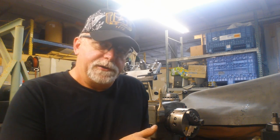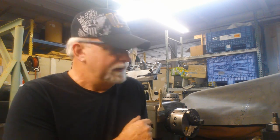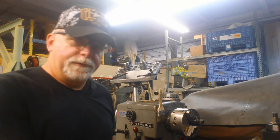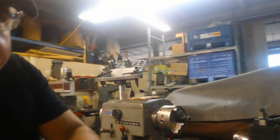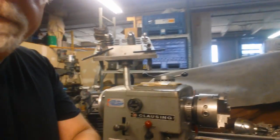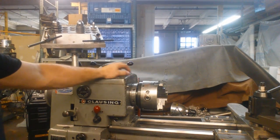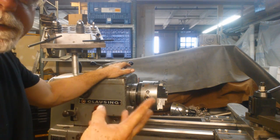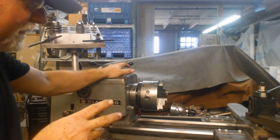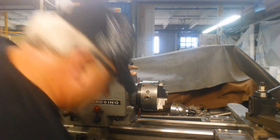I'm going to take it off first and talk about some of the things that happen when you're taking it off. It's interesting because you run into resistance on the extraction nut — or the locking collar, really, is what it is. You run into a couple different steps of resistance as you're taking this off. When extracting the 5C adapter there's like three steps of resistance, and taking this off there's two. So we're going to pull this off and show you.